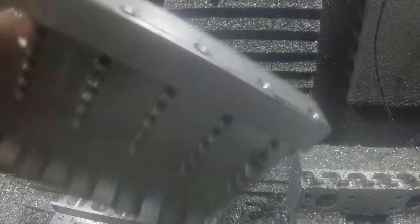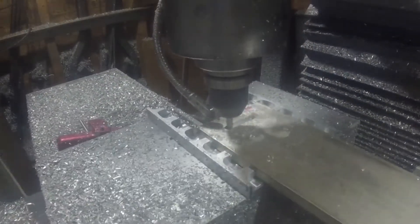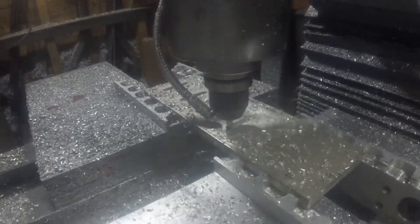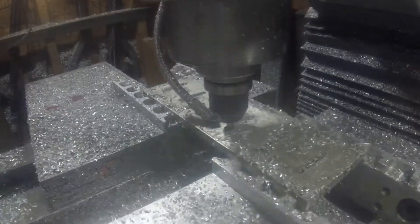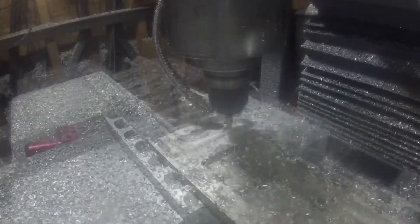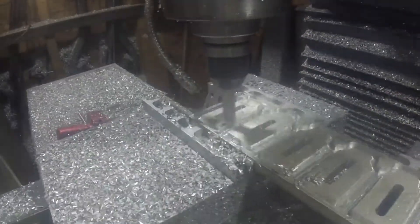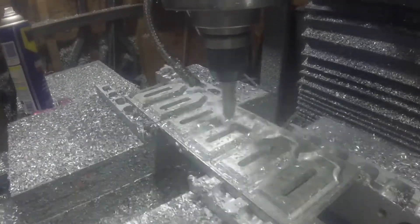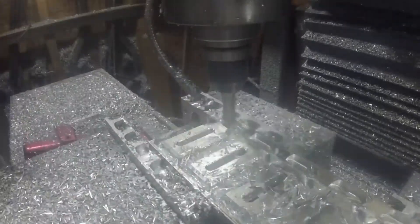So that's the main body done. But now we need some movable jaws. These jaws are going to have slots in them so they can slide forward and backward on the base. I wanted to chamfer all the edges before I broke them apart, so that's why I'm partially cutting the perimeter here. I'd like for the clamping edge of these movable jaws to have a low profile too, so a nice big angle on that edge.